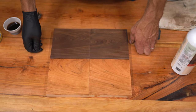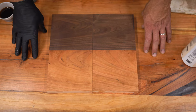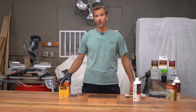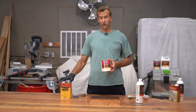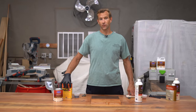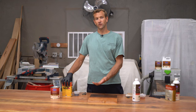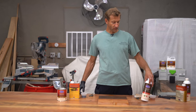With our first coat on, zooming in you can see there's really no difference — they look identical, which is what I'd expect. One doesn't have a better look than the other; it just has to do with application. The original sealer finish is compatible with Water Lox satin and high gloss as a base coat. You can also use it as a top coat if you like a semi-gloss sheen. The universal tung oil sealer, however, is not really great as just a base coat — it's going to need a top coat on top of it.